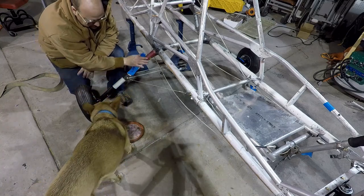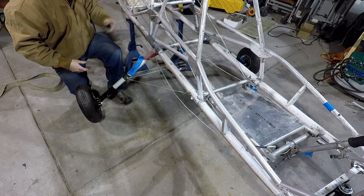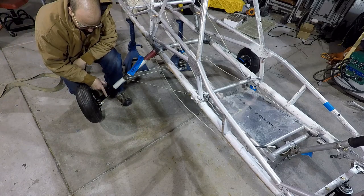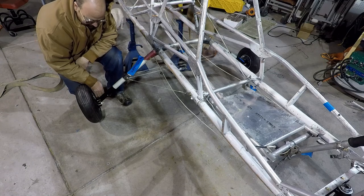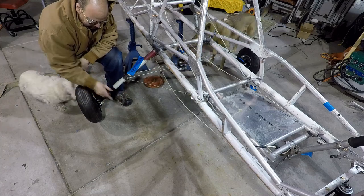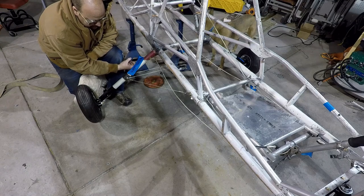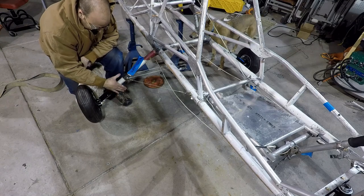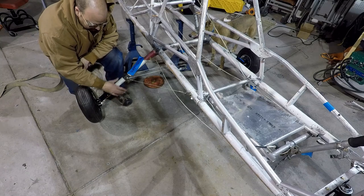I have this thing swapped side. They don't specify anything in the instructions that I remember, but generally it's best to have the caliper behind here for doing any field landings. You actually want your brake lines to come behind the landing gear. That way it's protected to some extent from branches and whatnot hitting it.